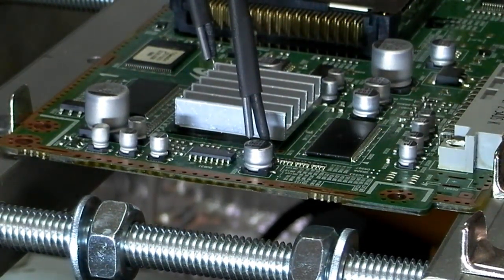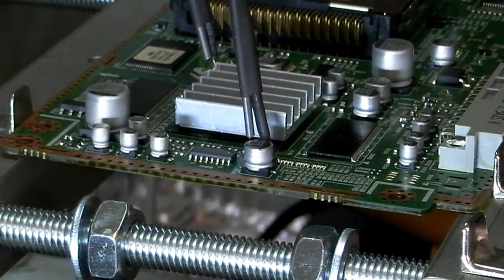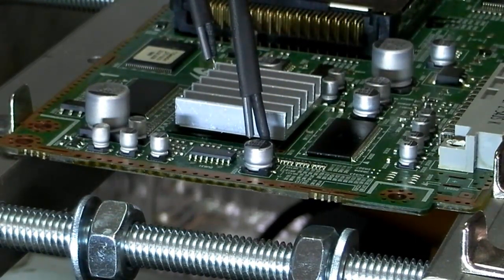You can see the smoke starting to come off. What I'll do is I'm going to just hand hold my hot air nozzle with no tips on. Eventually this will be fitted onto the arm, which you've seen in the previous videos, with a proper BGA nozzle of the right size, but as we haven't got that yet, we're going to have to do this by hand, and I'm just going to hold it in there like that.